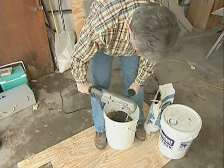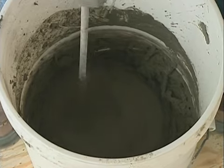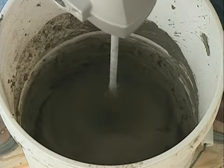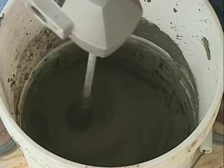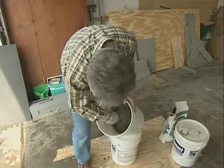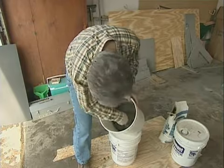On big jobs, you might rent a 1/2-inch electric drill and use a special paddle bit to mix a thin set. Run the drill on a slow speed and keep the paddle in the thin set. Don't blend air into the mix. Once the mortar's had a chance to slake, go back and stir it one last time. This will remove those last few lumps.